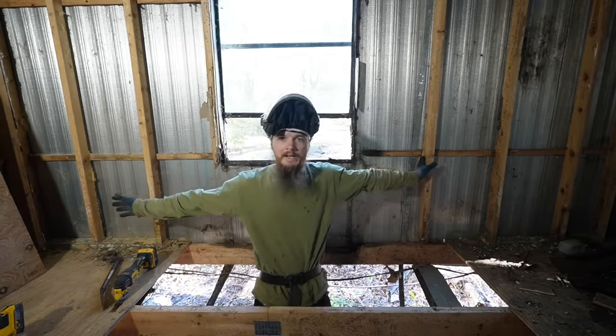A lot of mobile homes, the floor joists are going to run this way toward the wall. And some of those ends could be damaged. It's still the same process. Sister those up so you have some fresh wood sticking out. Yeah. That's it. If you can't get all the rot, it's not a big deal. But I try to cut out as much rot as I can because rotted wood is inviting for insects. I guess that's all we have for now.